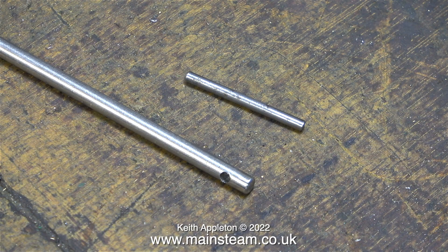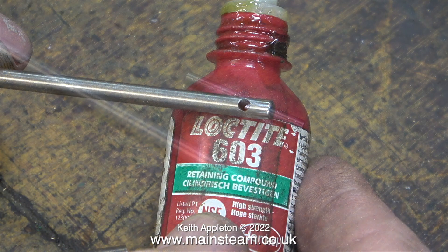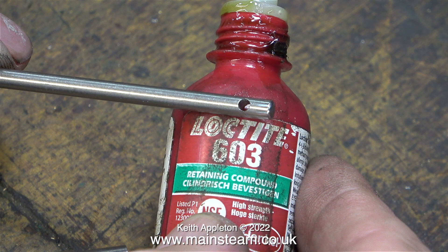In the end I did not use the piece of steel that I turned in the lathe as I've just shown. I only included that sequence to show you how not to do it. The piece of steel you see on screen is one from my box of small pieces of steel and it's a perfect fit in the hole in the main shaft. I cut it to the right length and cleaned up the ends. And now with some Loctite 603 retaining compound I'm going to fit the small piece of steel into the main shaft.